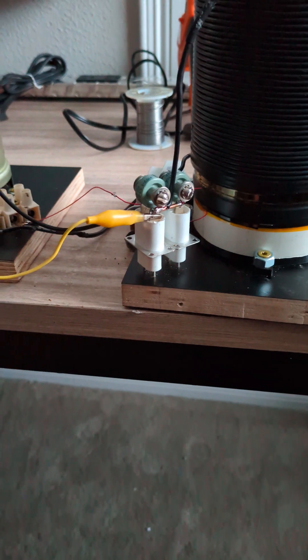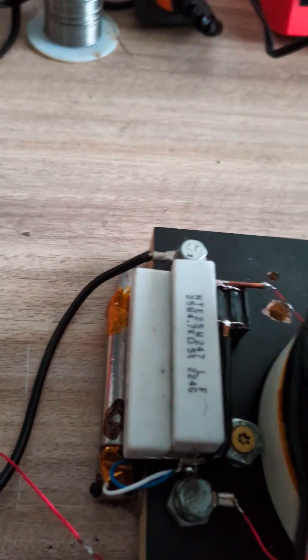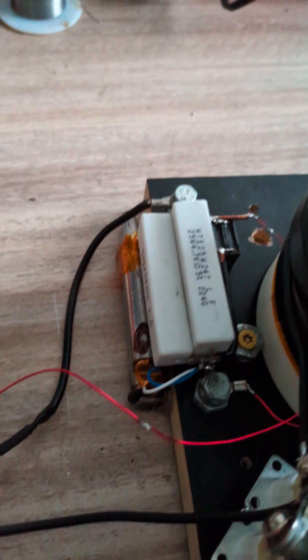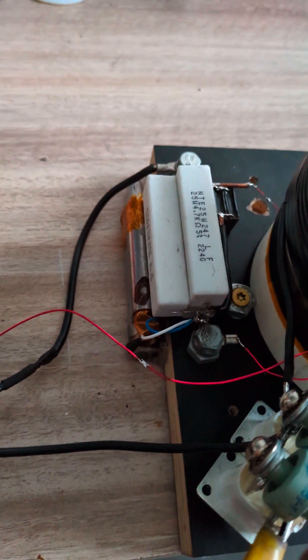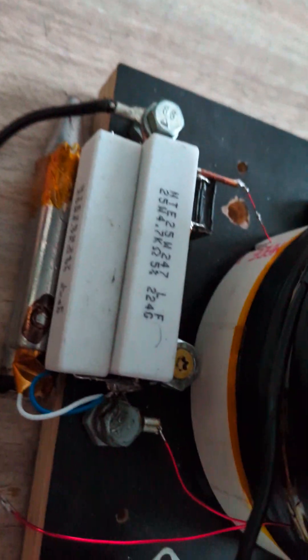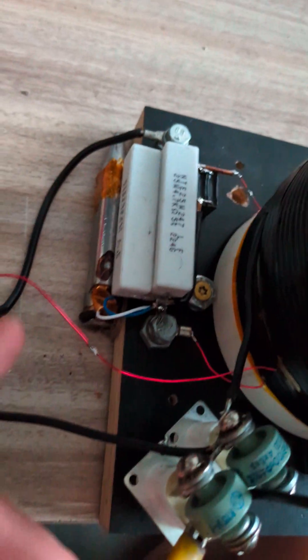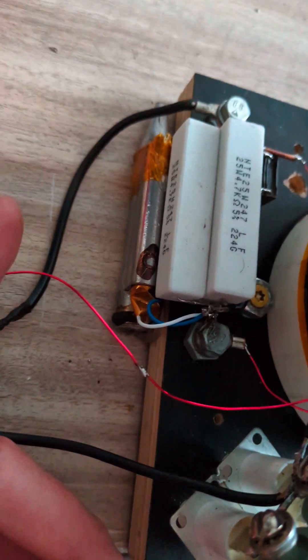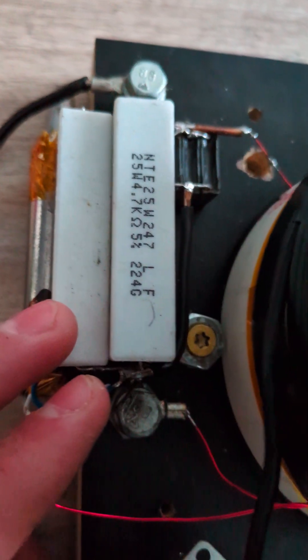It's never going to be perfect, but we will strive to get it very close. Here are the grid leak resistors. In total this measures to about 350 ohms. I know this is pretty low for a vacuum tube coil and it drives the tube very hard, but it does give me the best output. There's actually a hot glue gun module added right here because I didn't have any more of these resistors, and this acts like a resistor too. It's also wired in parallel with these 4.7k resistors.